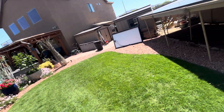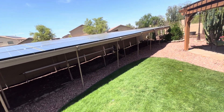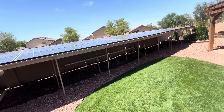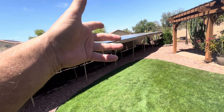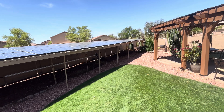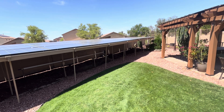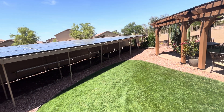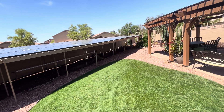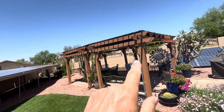There are 24 spots on that array, so I could put 20 solar panels on there — that would be 8,000 watts with up to 10,000 watts of bifacial gain — and still have room for 2 to 4 more solar panels. So I could get 24 solar panels on there and almost hit 12,000 watts on this one array using those bifacials. That is huge.